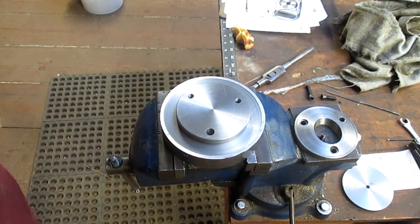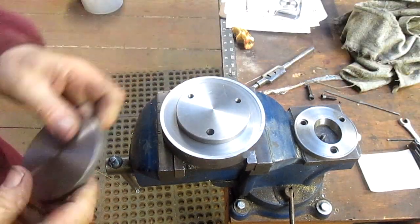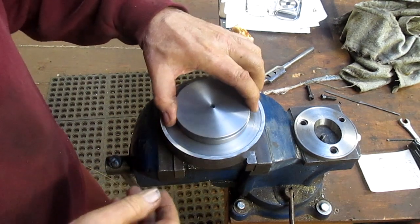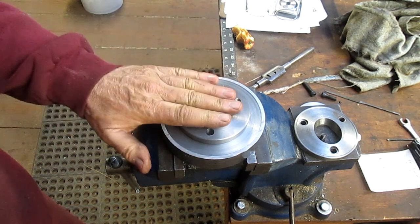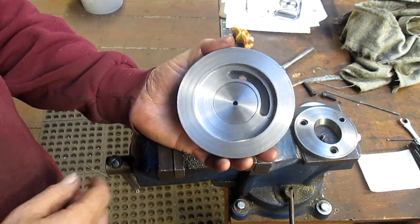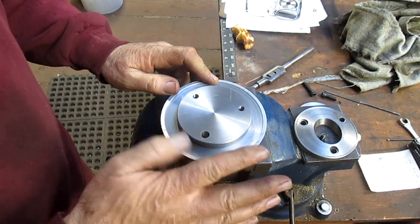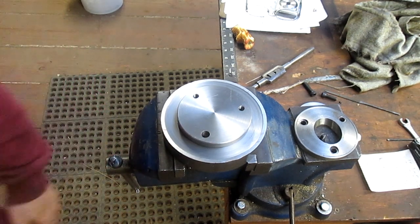So I think next, other than drilling the hole in the washer, which we may end up doing fairly quickly, but I think we can just do that almost on the drill press. Just put everything together and go straight through. But for the moment, I think it's a good idea at this point to go ahead and put it back on the lathe, and we're going to trim this shoulder off, and do a nice radius there so that it has a good finish to it.